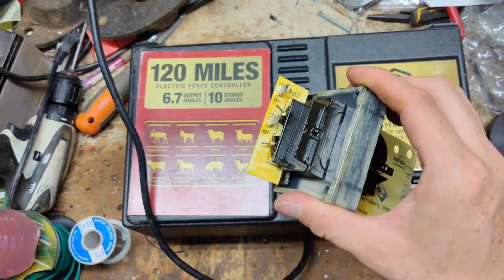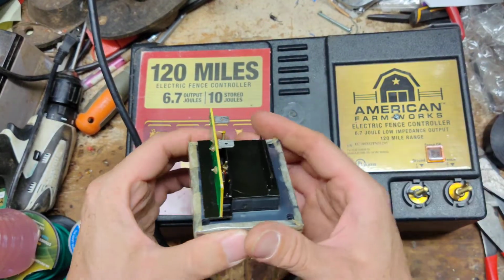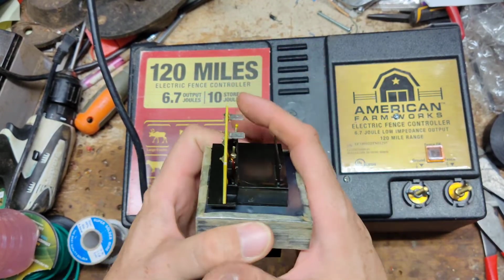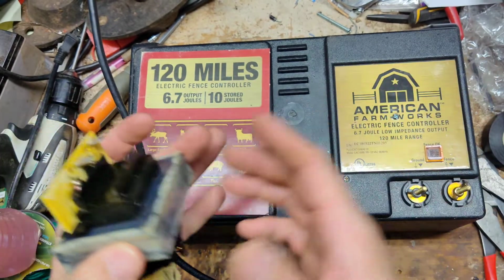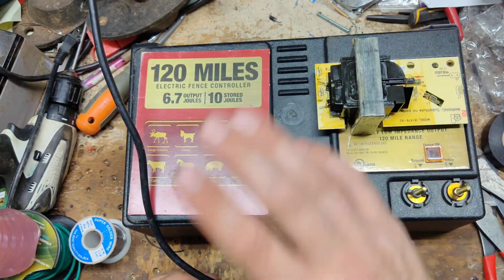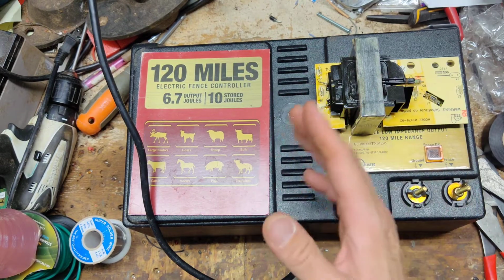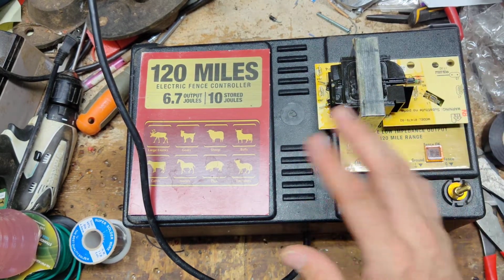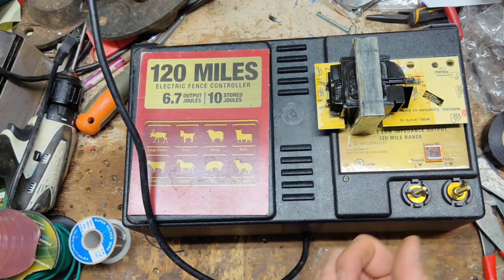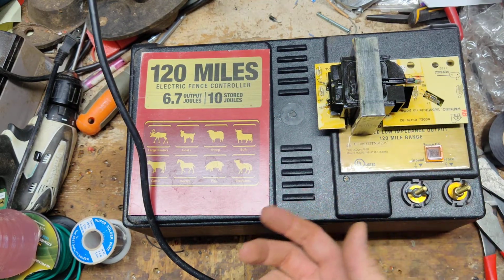the heat inside. Other ones do that, but they'll also pot the transformer, putting the whole winding in an epoxy, so it binds it together so it can't break loose. I guess it could still, but not very common. And then some brands, when you get to the mid-size and larger, will do something that different brands call different things. Gallagher calls it adaptive control, Cyclops calls it power on demand.